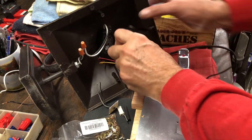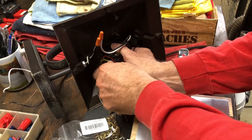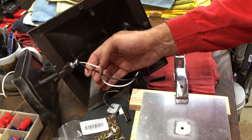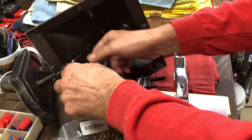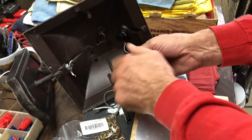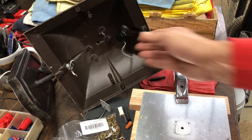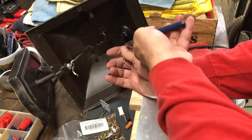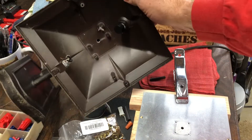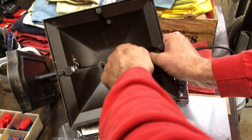I already loosened the two screws holding the driver in place — there's one and there's two. Take the two wire nuts here. Obviously, if you're doing this while the lamp is still on the wall, make sure you turn the power off — turn the breaker off. Remove these and separate them. Now you have the driver; we're not going to use it. I'm going to cut those wires because my lamp is connected to a switch — I turn it on and off manually — so I can remove them for a cleaner result.